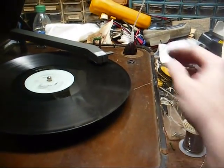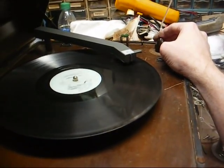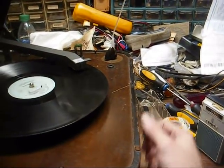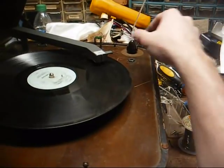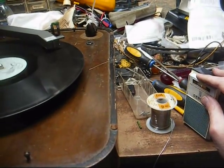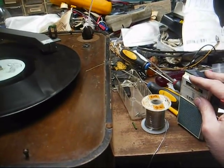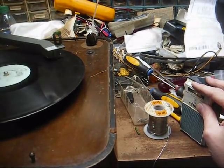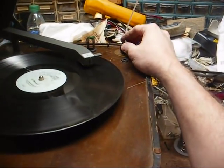Attention AM radio stations: they'd like to crank your modulation all the way up to max. Remember, more is not always better. That's more like what it should sound like, but this is what y'all sound like. That's the over-modulated gospel station. As you can hear, they both sound about the same.